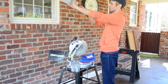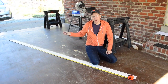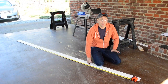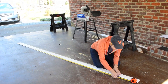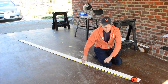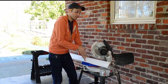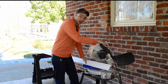What I've just made is a left inside corner cut so that when it sits there, another piece can come right against it at a perfect 90-degree angle. I've made my first cut on one end of the board, but when I make my second cut, I have to be pretty precise because that determines the length of the board. Always measure the side of the crown that's going to be against the wall, not the part at the ceiling. I've laid out my tape measure at 133 and an eighth and marked it. I sometimes err on making it a little bit longer than my precise measurement because you can always trim a board if it's too long, but if it's too short, you may have wasted a whole board.